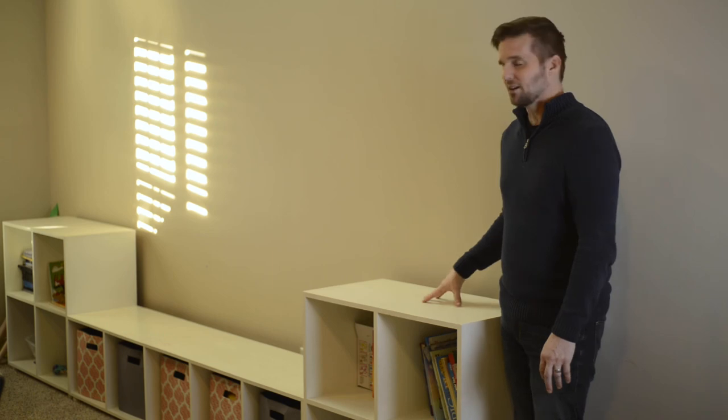The last projects I'll show you are these bookcases and cubbies I built. There's a lot of surface area here, so this was a perfect opportunity to use plywood — it made it a lot cheaper. Because I didn't want the plywood ends to show, I cut strips of solid wood and glued them to the front. In the back I chose really cheap fiberboard instead of the same plywood used for the rest of the cabinet, and it worked great. If you've got a question, put it down in the comments. If I left something out or you don't quite agree with something I said, put that in the comments too. If this video helps you out, consider subscribing. Thanks for watching and we'll see you next time.